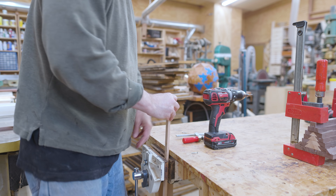I also wanted to make a trunk. I found a piece of walnut with a little more sapwood than the rest, hoping it would be lighter and show up as a trunk under the tree — you can see it, but it's really subtle. This is the widest piece at the bottom of the triangle. Once glued, I re-jointed each face since they weren't perfectly flush — that's why I left them slightly thicker than needed. Then it was just a matter of gluing everything together, one seam at a time, letting it set for 15 or 20 minutes before doing the next seam.